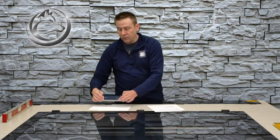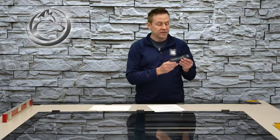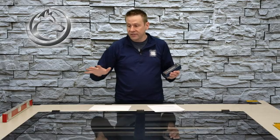Once the machine is settled, we'll go and repeat the entire same process all over again using one of these precision machinist levels. If you're struggling a little bit to get that bubble exactly in the middle, don't worry — you can be off a little bit. These things are so crazy accurate that you can still be off a little bit and still have a machine that runs very well.